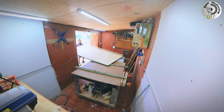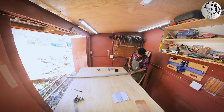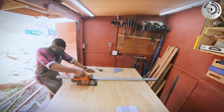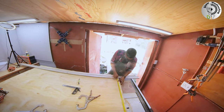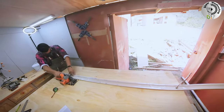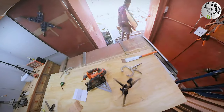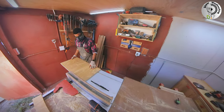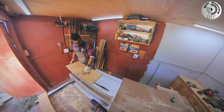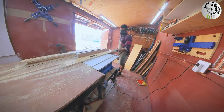I used three full sheets of construction grade plywood to build these chevron doors. To start things off, you'll need to cut up the base structure of the doors — the size will really be determined by the door frame you're working with. I used a straight edge to cut up two door panels with dimensions of 180 by 88 centimeters. Then we go on and start cutting up a bunch of nine centimeter pieces that will make up our diamond chevron pattern. I used up the leftovers from the two previous sheets, and on my second door I had to start on the third sheet.